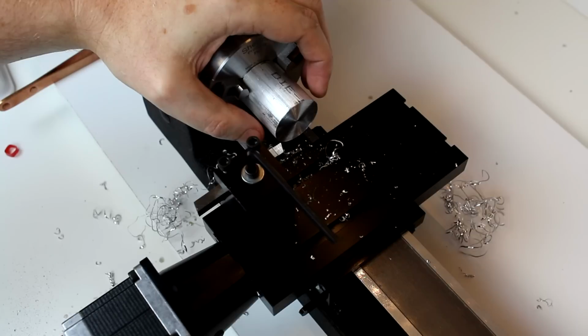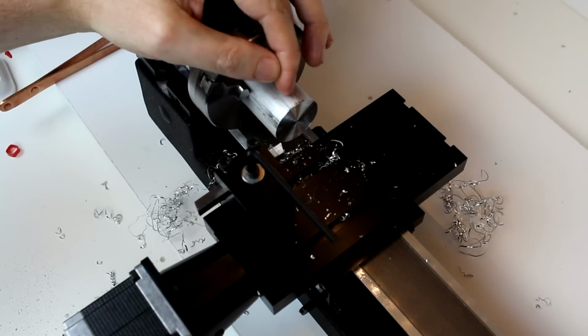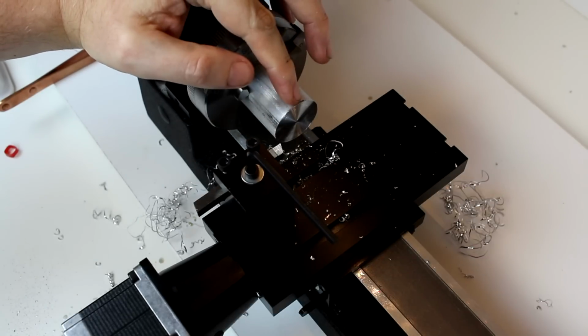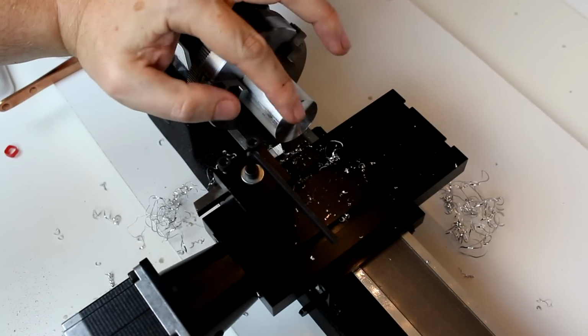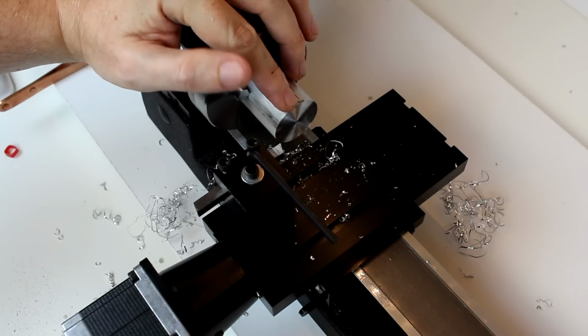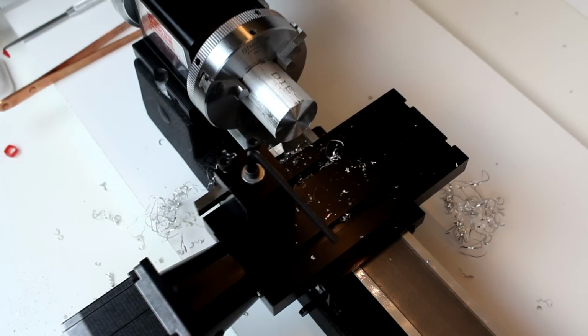Now in the reverse direction, from the opposite perspective, you don't want to start with a 1-inch diameter rod to try to get a 1/4 inch rod out of it. Now maybe you're doing a 1/2 inch or 3/4 inch piece with a 1/4 inch spigot on it. Then obviously you're going to have to turn that down. But otherwise you're going to spend a lot of time turning and reducing this diameter, and it's going to waste not only material, but more, it's going to waste your time, quite a bit of time reducing that diameter.